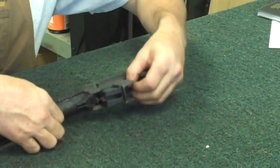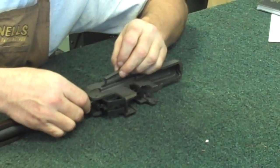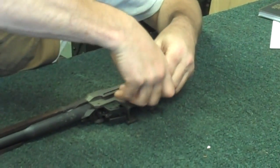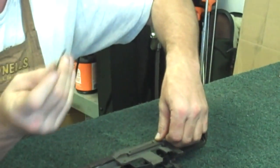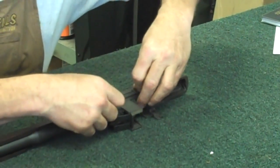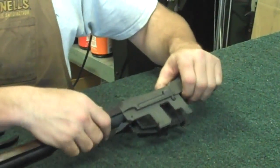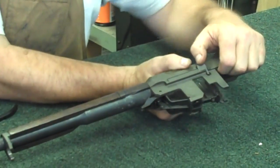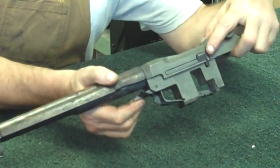Turn your gun back over on the side. Clip latch - you have the same thing over here. You have a large head on this pin; it goes from the front to the rear. I like military guns - they come apart so easy. Now you've got all that back together. You want to make sure it works. See your little clip latch? See this piece up here that locks the op-rod to the rear? Push up and down on that and you'll see your little clip latch moving.